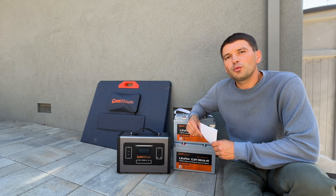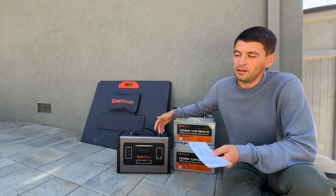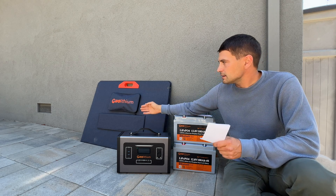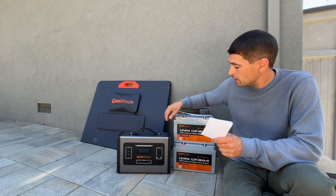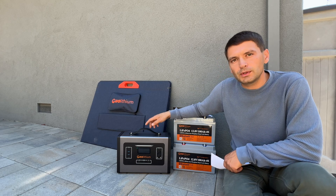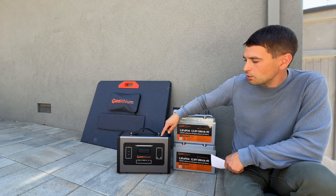That's all the tests I want to perform for this station. I'm not going to do a stress test because in my opinion it doesn't make sense — the station cannot handle 2 kilowatts continuous load, and for a stress test there would be even more load and it would just shut down. For the solar panel, it's a great panel — really easy to set up with one person because of these retractable legs. At 420 watts we can get about 2 to 2.5 kilowatt-hours in one day, so we can fully recharge the station. One improvement would be to provide plastic caps for the studs so we cannot short them, since the power station is metal. Even some covers where we can install batteries in a stack with the power station on top would help.